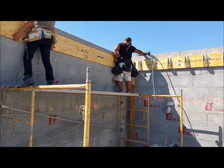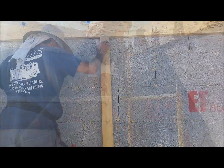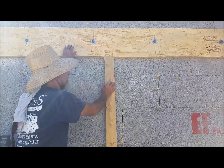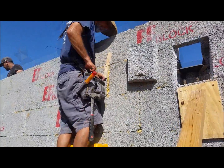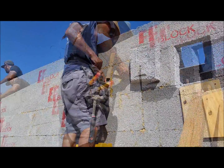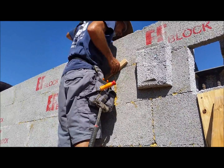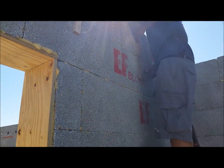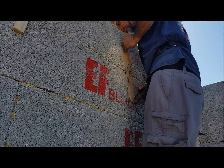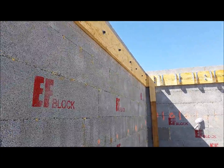We're going to put this ledger up here. You can see how they got the bolts pushed out of the way. Alan's going to grab it just to hold it in place while Shorty toenails the other end with the nail gun, and Alan will shoot this brace in. Alan's going outside now to pull the wire through — it's hooked on the j-bolt. He'll twist it and that'll pull the ledger tight. When we grout, the grout will go around all the anchor bolts.